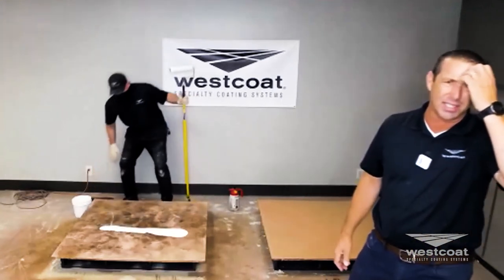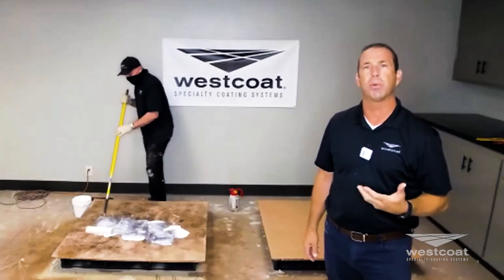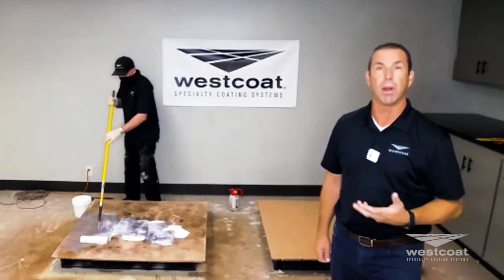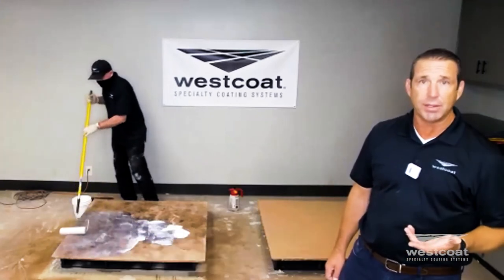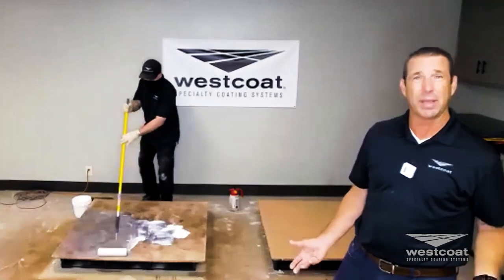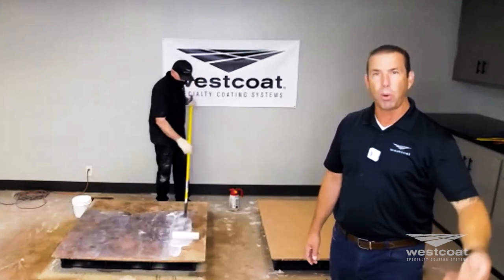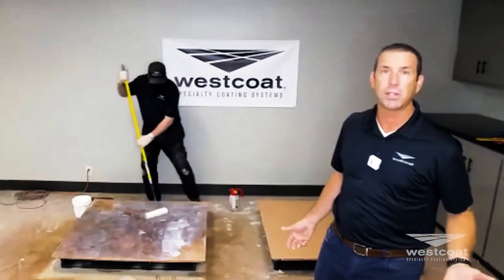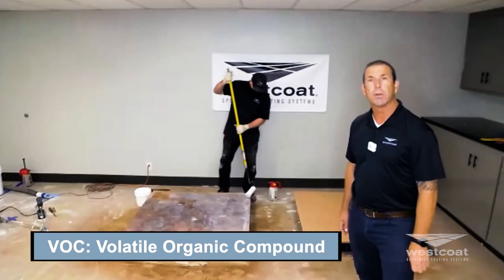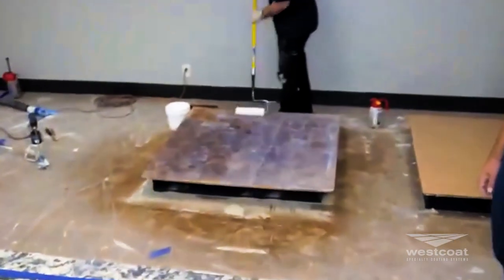Back on the sealer — the SC65. One of the beautiful things about the SC65G, the SC65S, and the SC65F is it's an incredible quality product. You have the qualities and durability of chemical resistance and abrasion resistance of an aliphatic polyurethane, but there's no smell. Anybody who's been doing this for a long time knows the smell of solvented polyurethanes — that was really all we had available over the years. There's no smell to this. In production, you can make solid positive points to using these products, specifically in California, which is the toughest VOC state in the country.